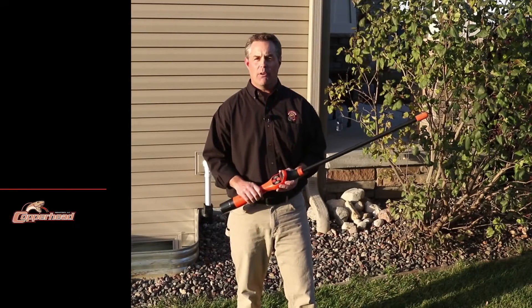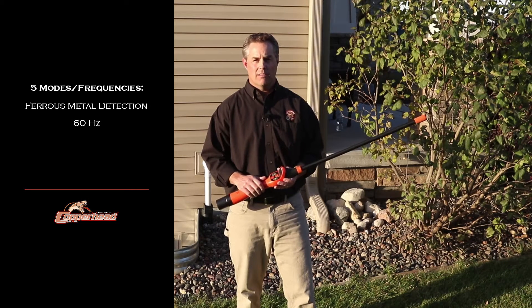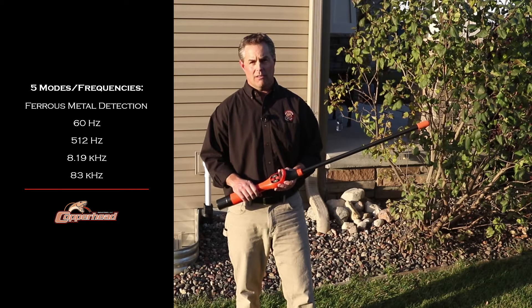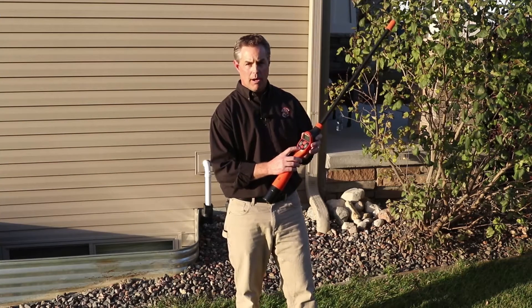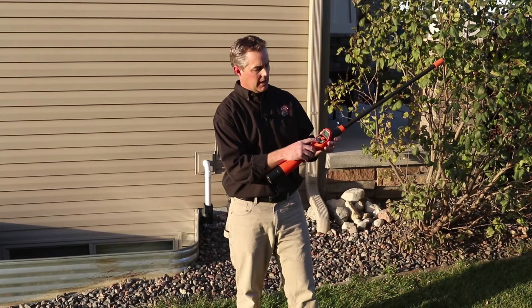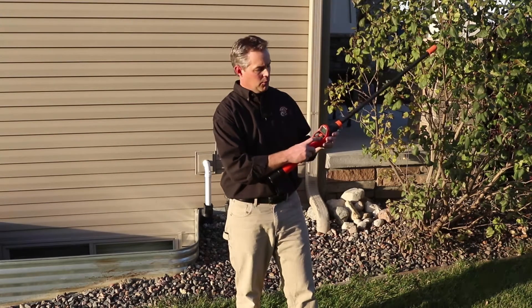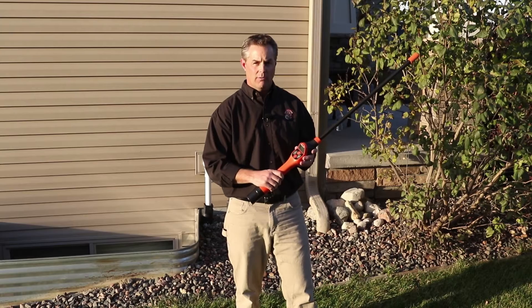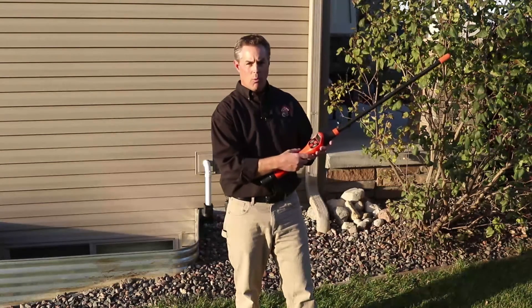The Viper Mag receiver has five different modes or frequencies: a metal detection mode, a 60 hertz frequency, a 512 hertz frequency, an 8.19 kilohertz frequency, and an 83 kilohertz frequency. To change the mode or frequency, press and hold the mode frequency selection button to get into the menu, then use the minus or plus button to toggle through. Press the mode frequency selection button again to choose that mode and return to the active locating screen. Toggle to metal and press the button again — now we're in metal mode.